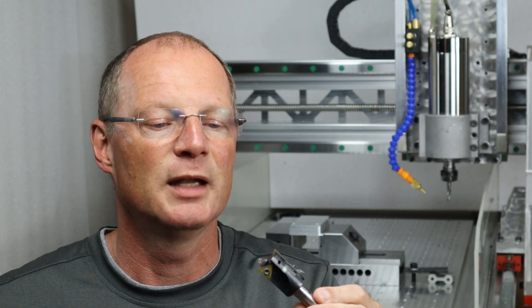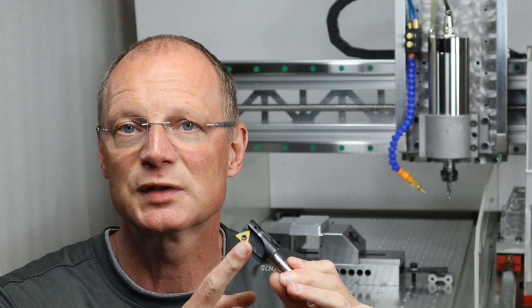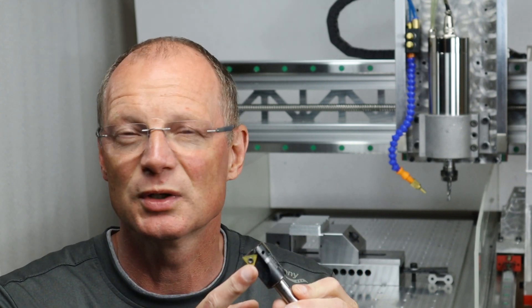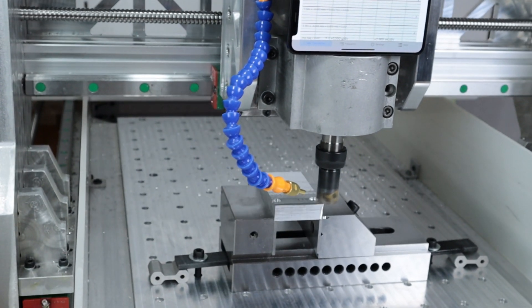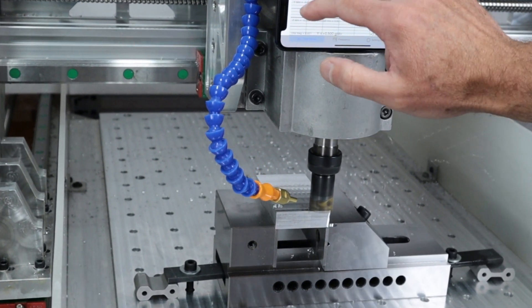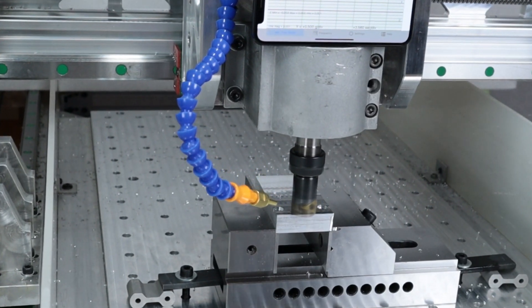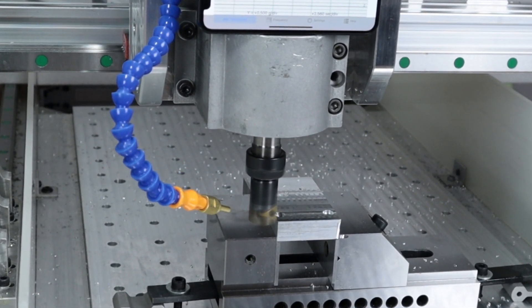I was sure this tool would introduce some vibration to my machine. For one, it's a one-inch tool with the wrong inserts for steel, so it squeezes the material off. I have machined a shaft with it, so it's non-balanced, and I know that my machine has vibrations using that tool. So I wanted to see if the bracket could make a difference before and after.